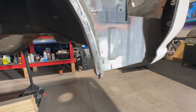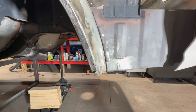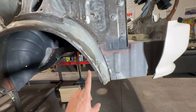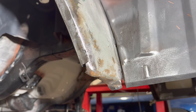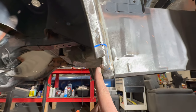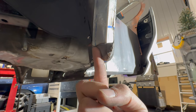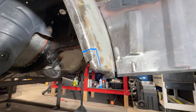For the final repair, we've got this little corner piece. This will give us a good sense of metal shaping. We're missing this little connection piece — I've already rebuilt the flange, so we just have to finish off the bottom corner. I'll use tape to map it out: cover the area, mark the shape and where the bends are, keep it in one piece, peel it off, and that tape outline is our template. Let's get over to the bench and start making it up.